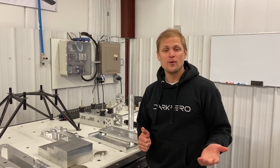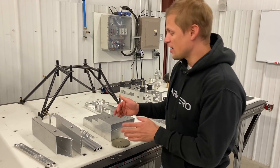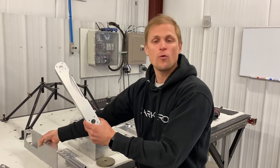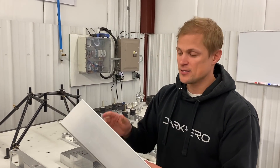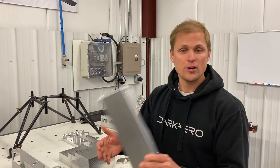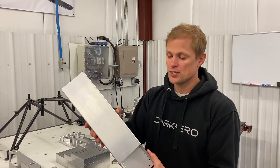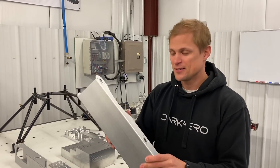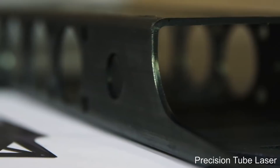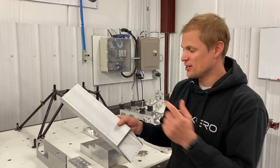Keegan's been doing a whole bunch of work machining parts on the Tormach. In between our last shop vlog and this one he made all these parts which we haven't shown you yet — these are the engine mount uprights, and they form the backbone of our engine mount. They're made from stock that's an extruded aluminum tube with a rectangular cross section. We start with that rectangular tube, throw it on the mill, and cut out these holes to turn it into the engine mount. Milling works fine for this, but in production we're going to use a laser CNC tube cutting process — we'll outsource that. It's a pretty fast, efficient process for cutting shapes from extrusions whether square or round tube.